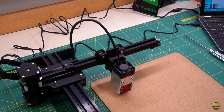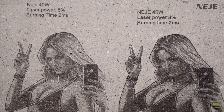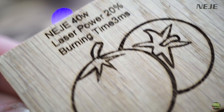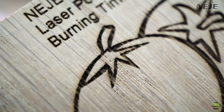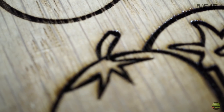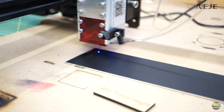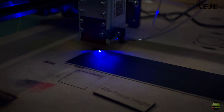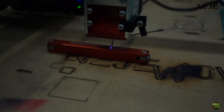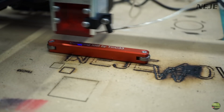After focus was set I tried some engraving. Engraving on MDF with quite low power and short burning time gives a nice result. Deep engraving is even better — lines are nicely and evenly engraved because there's enough power to burn hardwood too. Even for cutting this laser gives amazing results, much better than 20W or 30W, I think because of the better lens and better focus. I also tried anodized aluminum sheet sold for laser engraving — the 30W model doesn't even touch it, but the 40W makes a nice engrave in a single pass. On homemade anodizing the result is much better because the anodized surface isn't as tough. Someone asked about stone — the laser leaves some traces on the surface, but it may work on the right type of stone.